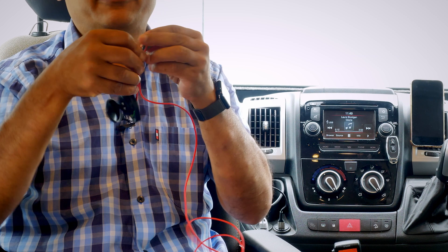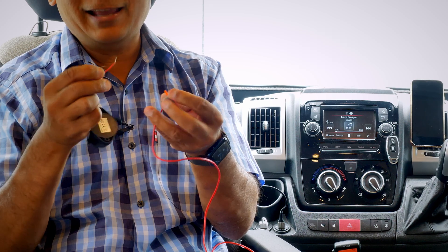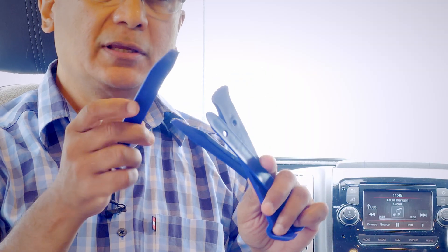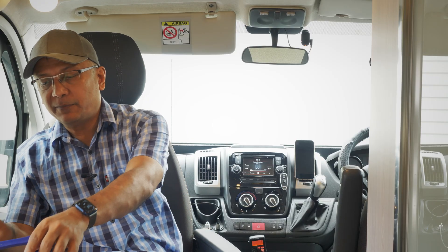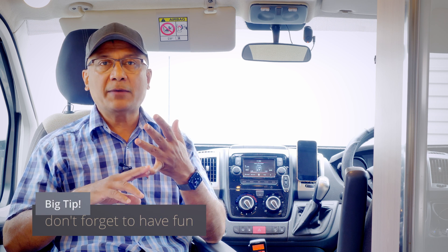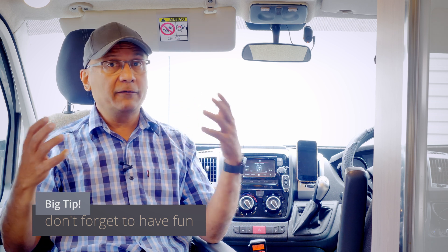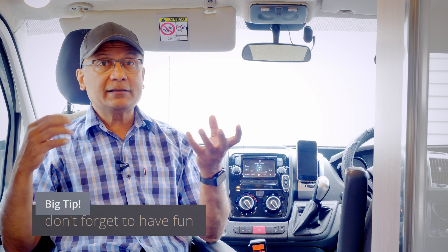To connect the other end to your USB power supply, just lift up the other side of the easy connector — it's that simple. You may also want to get some upholstery trim removal tools, which are just plastic pieces that make hiding cables much easier. For preparation: make sure you have enough time, adequate lighting if it's dark, your favorite coffee or tea, and a small bowl to put screws in as you remove them. Keep your phone handy to take photographs as you go.